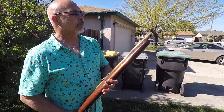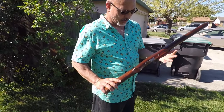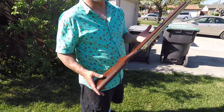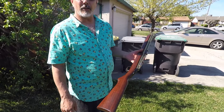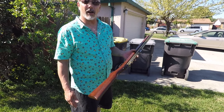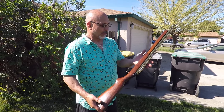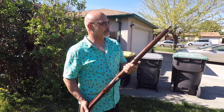So you took it apart, redid everything — the seals, and even the wood too. Yeah, I stripped the wood and re-varnished it, stained it. Used walnut stain instead of mahogany because it's a walnut stock, and they originally used mahogany stain. Why would you use mahogany stain on walnut? Doesn't make sense. I got vintage black walnut stain, stained it and then varnished it.